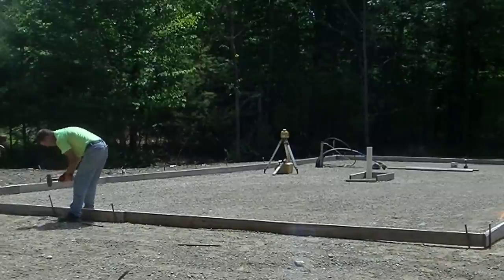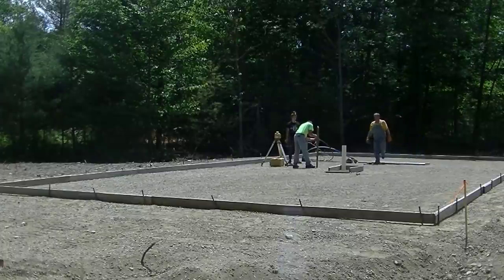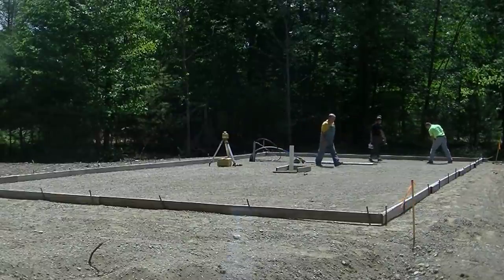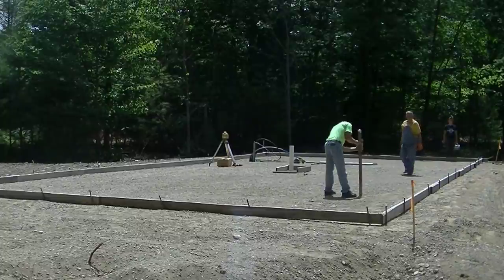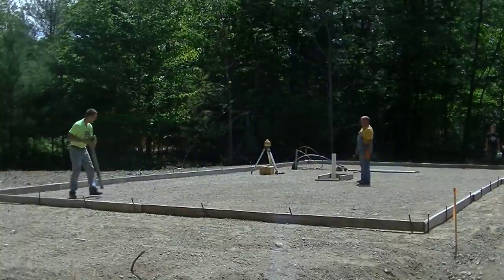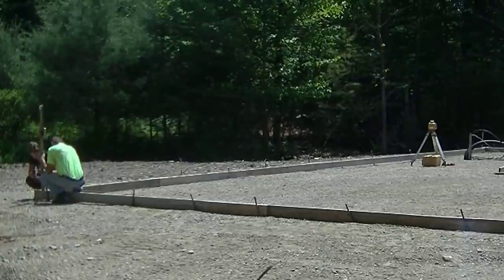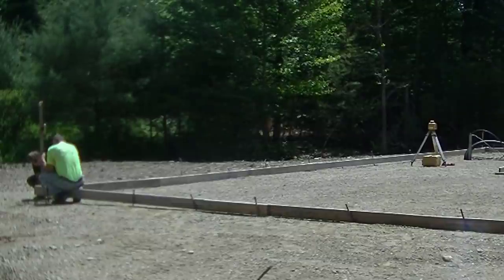You can see how I'm making sure those are nice and tight — just to where I get them there so they're going to be firm in the ground. The ground was pretty solid here; he put in about a couple feet of gravel, rolled it, and compacted it. Now I'm going around checking his dirt grade level. I want to see just how level he got that, because I've got to put at least an average of six inches of concrete in here. It's okay if I have five and a half inches in one spot and six and a half in another — just as long as I average about six inches. Once I get that average of the dirt, I can adjust my receiver on my grade stick down six inches to get my top of form for the slab.